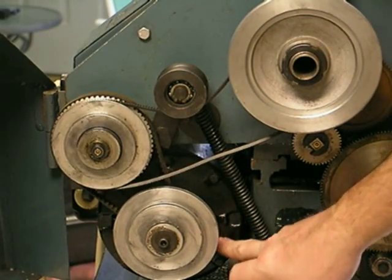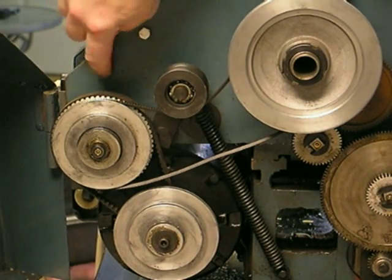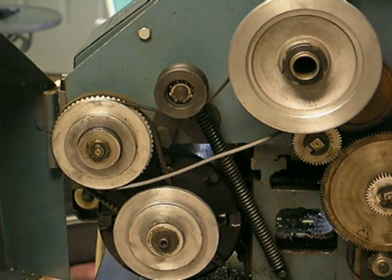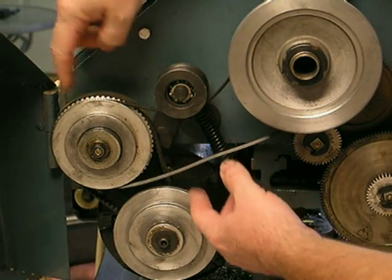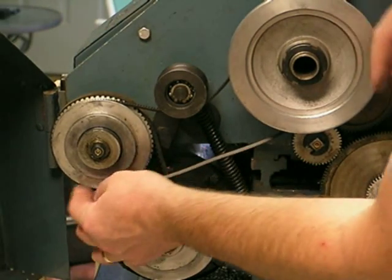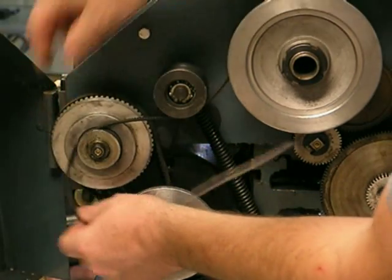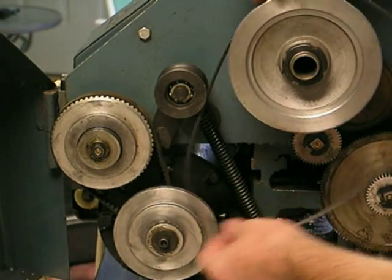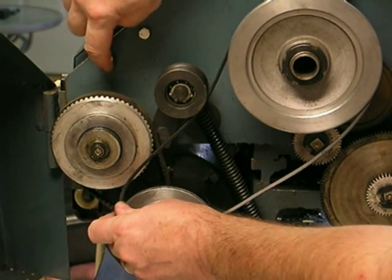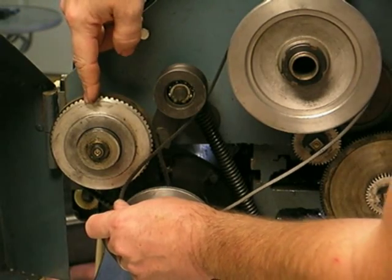Some people were saying that they moved the motor mount around to do some of the adjusting, and moved its back plate around to do the other adjusting. I don't see how this is going to help me on this one pulley where BC3 is loose but BC1 is tight. I don't see how I can move this back plate to adjust for both tightness and looseness on this one pulley.